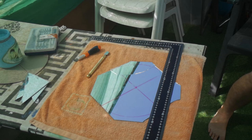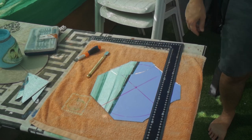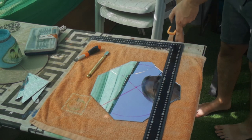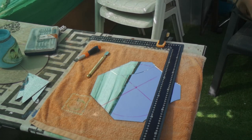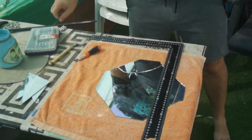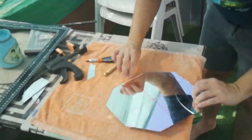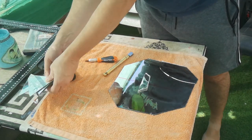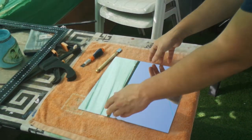I wasn't going for a round one with this glass cutter because I'm not skilled enough. If I had more mirrors I could probably make it work, but I only had four. I should have bought more. This time I used my brain a little bit and used clamps to keep the ruler in place, but this has mixed results because the mirror is still loose and can move. You can actually break off pretty small pieces without cracking if you use the ball on the back of the glass cutter and just tap along the score line.